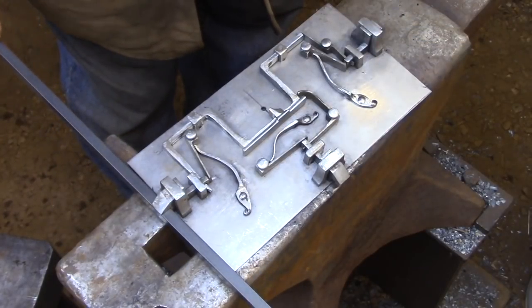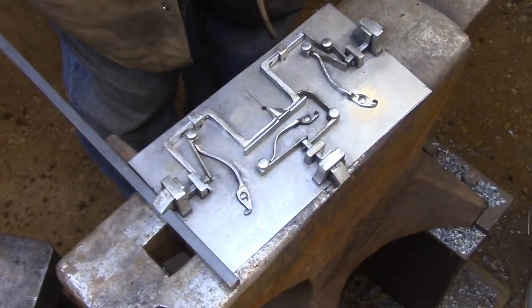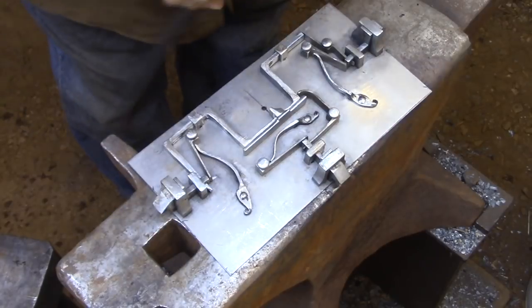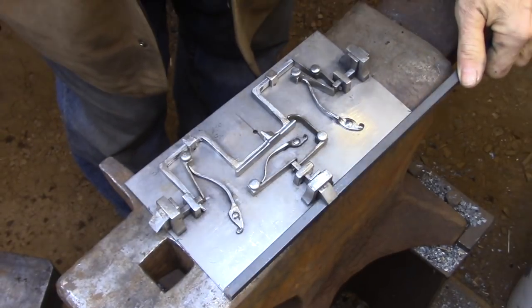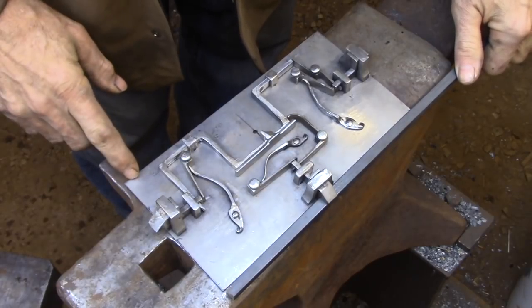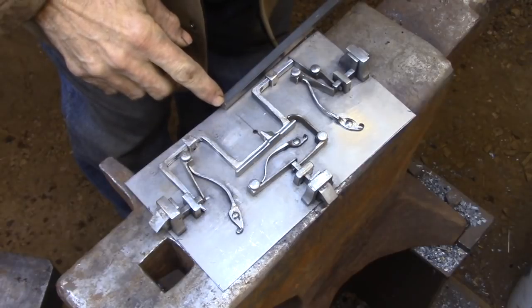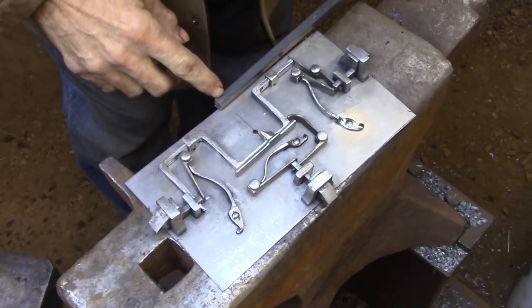The top rim of the box is made around a heavy steel frame, and it's that frame that the bolts latch onto when the lid is closed. So the frame is just basically a square ring that wraps around all sides of the box, and I'm going to overlap the ends of the bar and weld them so that it makes one continuous piece.